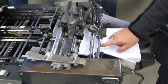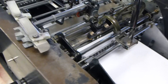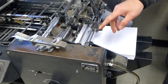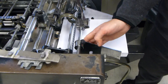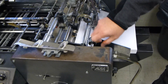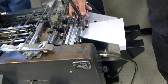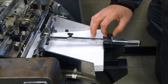On your bale bar — our book calls it a pile height adjuster — there's a scale on there. You're going to visualize side to side. Your paper needs to be centered on your register board, or on your feed board. Your two side guides are held in place by thumbscrews. Loosen the thumbscrews and push in your side guides, visually checking that you're centered on the feed board. Once centered, tighten the thumbscrews. Your paper should be able to move freely — not clamped in by the guides. Then your tail clamp guide needs to move up just to touch the edge of the paper.